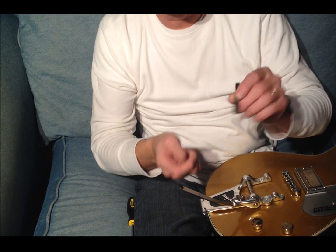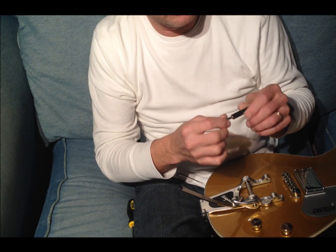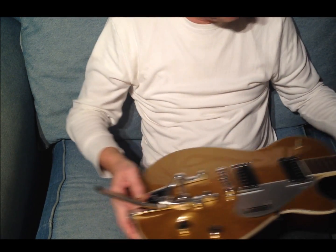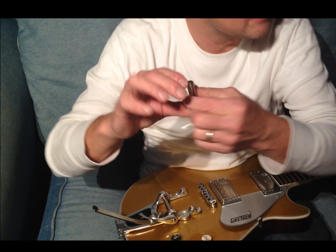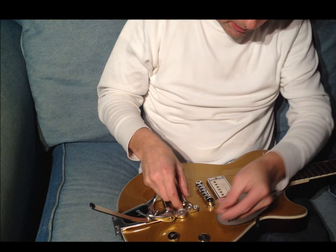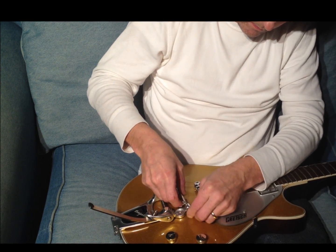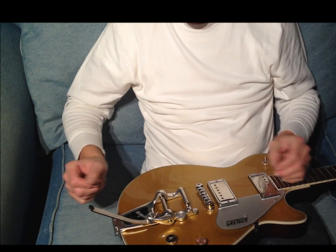And then if you look real carefully, you'll see inside the roller is a brass bushing, and it does pretty good if you don't have too much pressure on the roller. But anyways, putting the stabilizer on is as simple as, by the way, listen, didn't hear anything, did you? So you just drop the stabilizer in, push the axle through, and now it's ready for tightening the set screw.